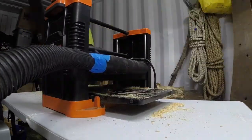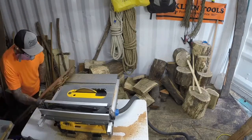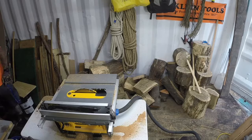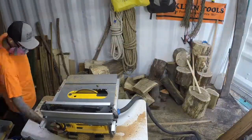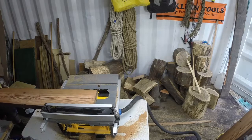In this next video clip, I ripped them. What I did was I ripped the inside edge off the 2 outer boards, and I ripped both edges off the inside boards. And all I did to hold this table together was I cut wooden dowels and just glued them in, and then glued them together and clamped them. There's nothing holding it inside but wooden dowels and glue.